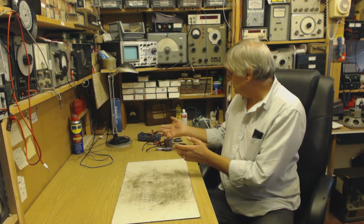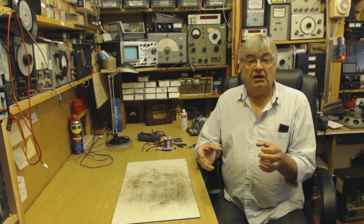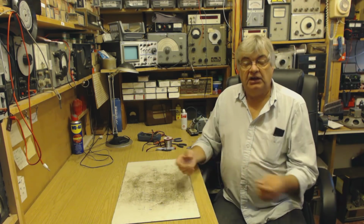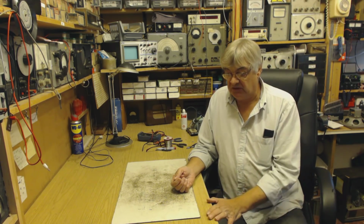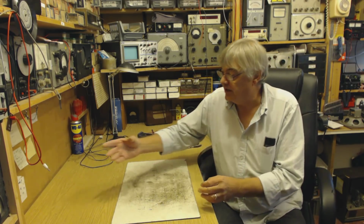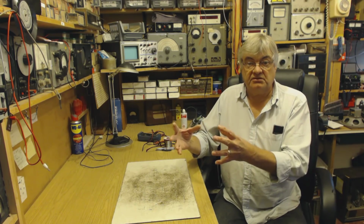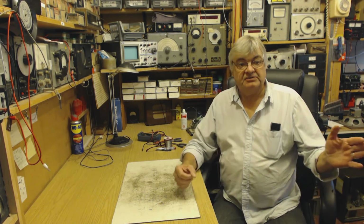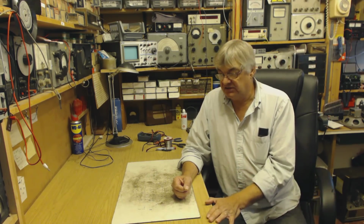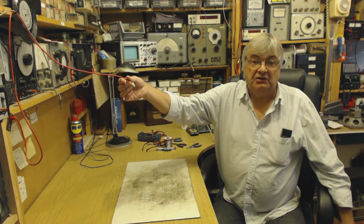So take a transistor radio. Where's mine? Over there. It's not connected to the mains. It's only got its little aerial. We can walk round. If you've got a really noisy motor causing a lot of arcing and interference, wherever you go with your radio, if you go near a socket, an outlet or any of the wiring, you'll hear it. Brrr, dreadful interference. That is because the house wiring is transmitting that interference. So again, it's airborne. That is coming down your aerial.